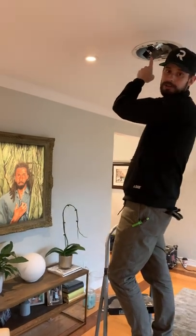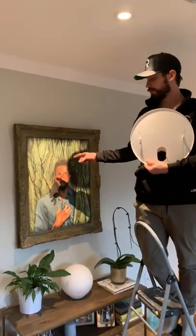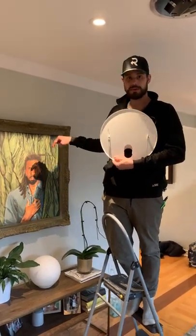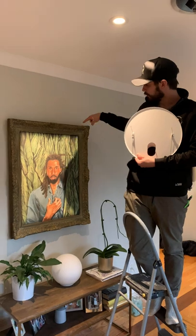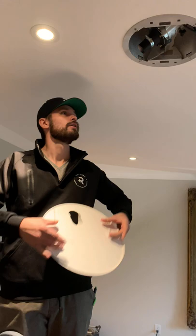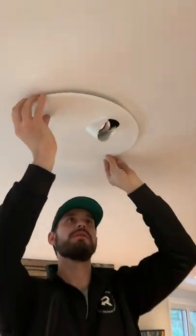Now I'm going to tighten up these joints and put the cover back on. An important thing to remember before covering is that I like to adjust these beam shapers with the brightness at full. Most people may not like the look of full brightness on the artwork itself, so once it's set we'll dim the light and make sure we like how it looks. It's just a little bit easier with full brightness to see your perimeter and make sure everything's set. Alright, everything's on — now let's go mess with the dimmer and see if we can make it look special.